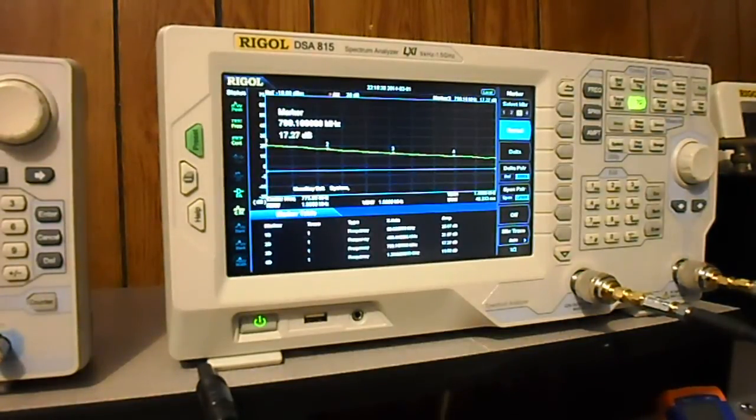I don't have a lot of time left in this video, so I'll save measuring the noise floor for another video. I'll see if I can actually measure that half dB noise figure — at mid-band they spec it from 0.6 dB down to 0.4 dB from 100 MHz to 2.4 GHz. I can go up to 1.5 GHz, so it should be between 0.4 and 0.5 dB. I might try video averaging, and use the reference trace feature to compare and see if that measurement shows up.